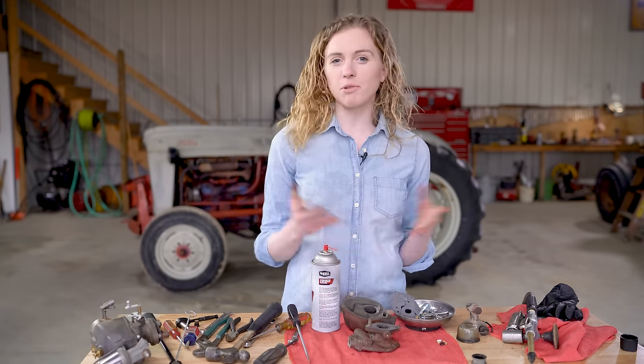After that, I'm gonna set my float into place. I wanna make sure that the pontoons are straight across. They aren't bent at all. So I'm just gonna do a little inspection here. If you do decide that your pontoons are bent, you can move them ever so slightly right here at the joint. Usually they're just fine to install, just like that. So with these pieces into place, we are done with the top of the carburetor.